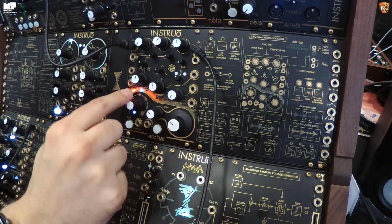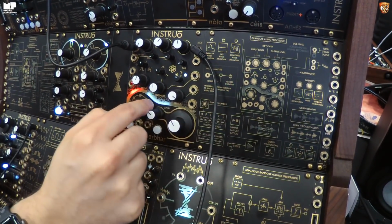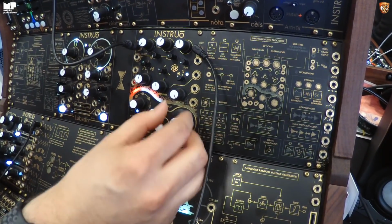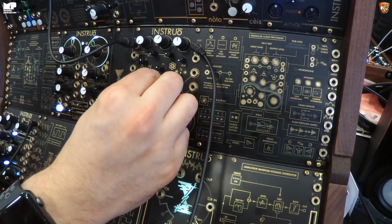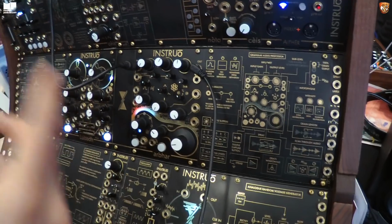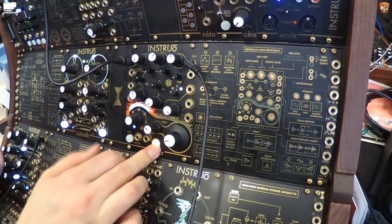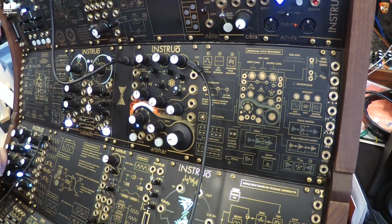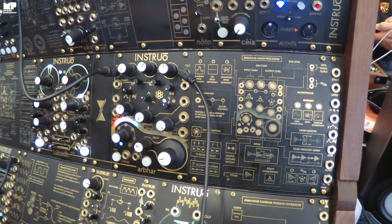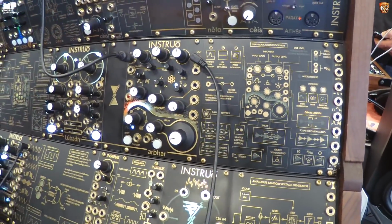So visually, we've got the scan position in the buffer. Length will give you up to three seconds of length per grain. For how many grains, there's the intensity control, where it's internally clocked grains, it'll go up to 16 polyphonically. You can manually clock more, so you can get up to 24, I think it is. These values we're still playing with optimizing, so we might be able to squeeze more out of it, but sonically, we've been working a lot to keep it consistent.